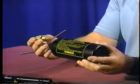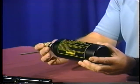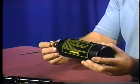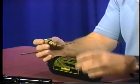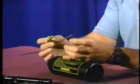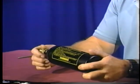And what it does is when it's screwed onto the gun, the tube actually points up. So when the bottle's laying on its side, the liquid's here, and the tube goes up into the upper area of the cylinder and extracts gas instead of liquid. It's installed this way right here. Now you'd have to mark the cylinder to indicate where it should be installed on the gun. So what we do is install the valve onto the gun itself, and then install the tube onto the valve, and then install it into the cylinder with the proper Loctite and torque to the proper specifications. And then you mark it. If you can see right here, there's a little X on the cylinder itself. That means that should be in the up position when the cylinder is installed on the gun.